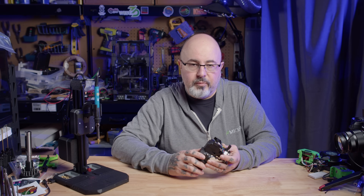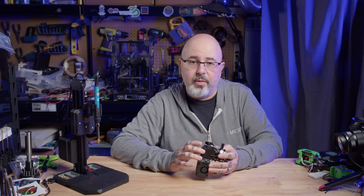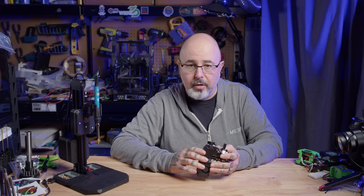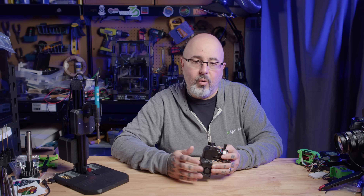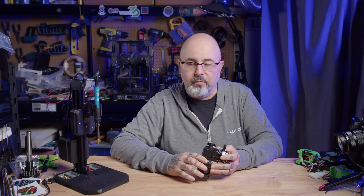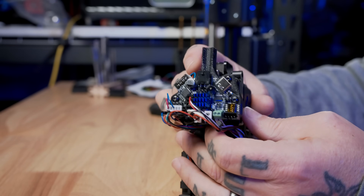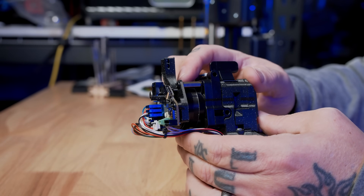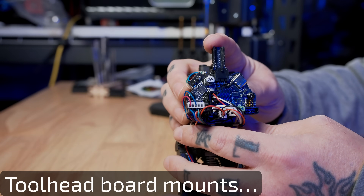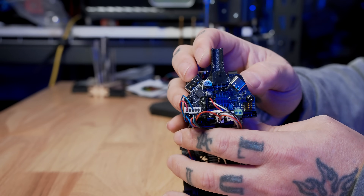A couple of things I learned when putting this toolhead together: the Dragon Burner housing for the Roto Vitamins is not compatible with the Orbiter 2 spacing on the hot end mount, so you're going to need to reprint that part. Whether you have an Orbiter or a different extruder on your Dragon Burner currently, you have to go to the repo and look for the version that has no extruder listed and then this will fit properly. Also, the extruder motor is turned 90 degrees relative to an Orbiter 2, so Orbiter 2 toolhead boards will not work with the Roto Vitamins — I believe this one is from a Sailfin extruder. I'll throw a link to that in the description.